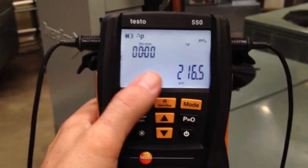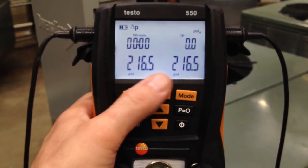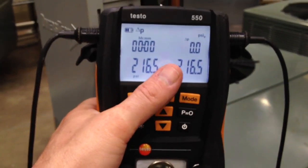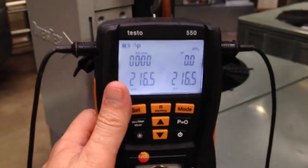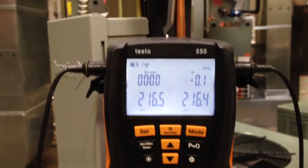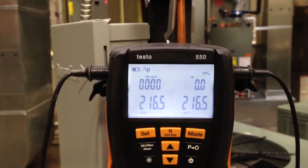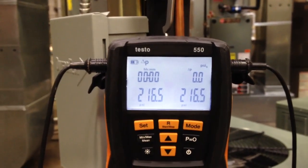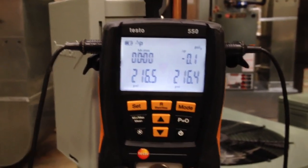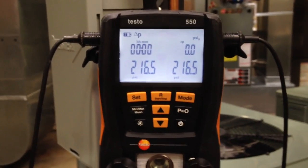If I push start, you're going to see it starts to flash and it actually recorded my starting pressure. What it's looking at now is my starting pressure, my measured pressure, and the difference between the starting and measured pressure over time. One of the cool things this does is it uses the gas laws and the temperature sensor — it actually measures the temperature of the line and the pressure. If this was nitrogen in here, it would use the pressure-temperature relationship and the gas laws to determine if the system was leaking or stable.